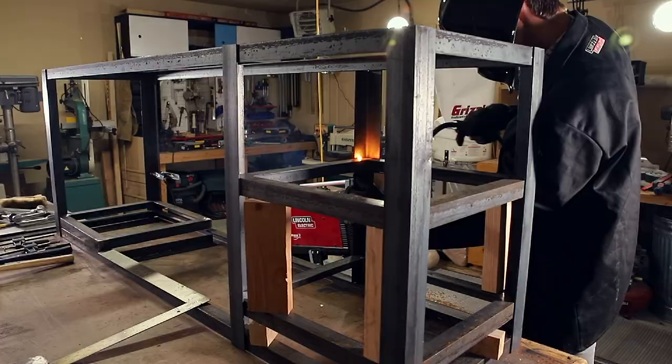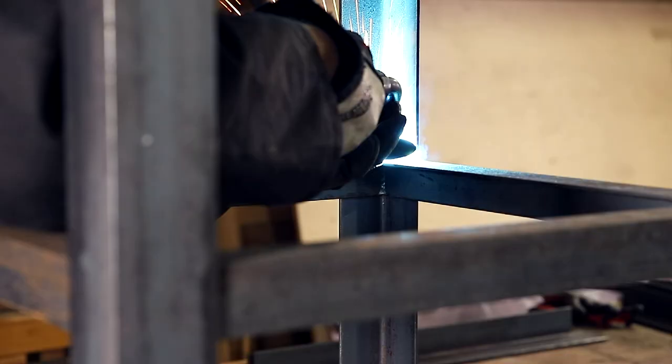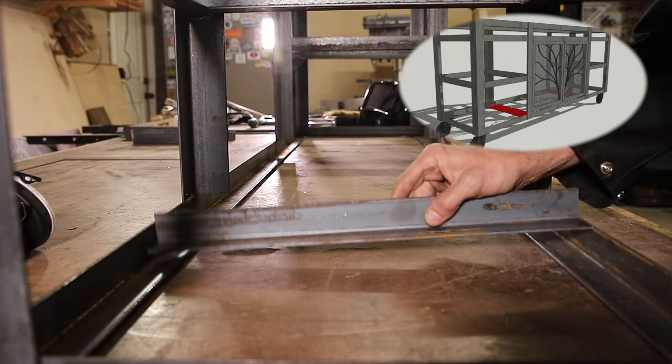To get consistent spacing on both sides, I made spacer blocks out of some scrap 2x4s and these hold the frames in place so I could tack weld one end. Next, I added the vertical supports for the center of the console and then I could weld the other side of the shelf frames in place to the vertical supports. The bottom shelf sits inside the lower frame, but I had to add a cross support like so, and then I had to notch out the end so it would sit down within the frame.